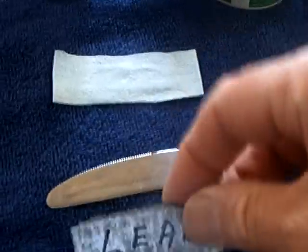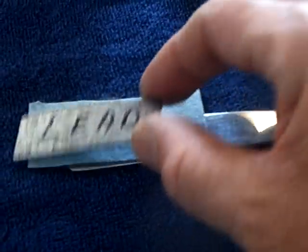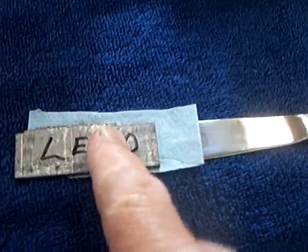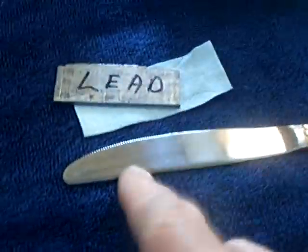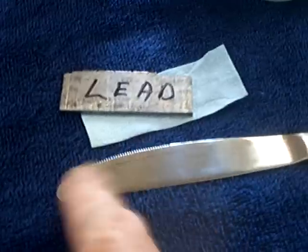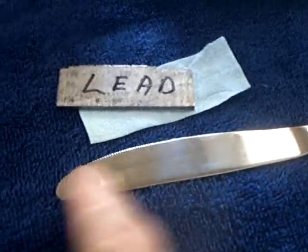I made a cell with this as the positive and this as the negative, and I put the red lead between the two using distilled water and alum. It was a very, very good cell, and I charged and discharged it, keeping checking it for days and days. When I took it apart, the negative remained okay. The positive formed a brown coating on it as expected, but the stainless steel was okay. It had a crystalline structure of the alum and the sponge lead — it looked gray.